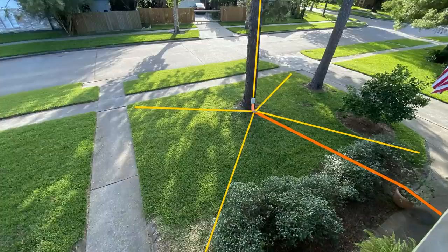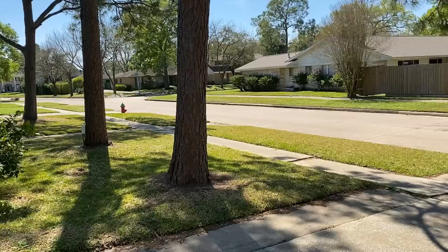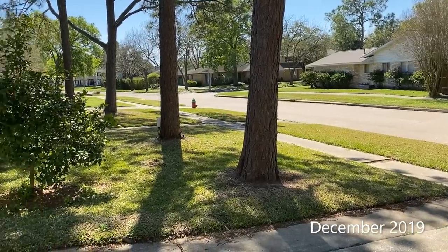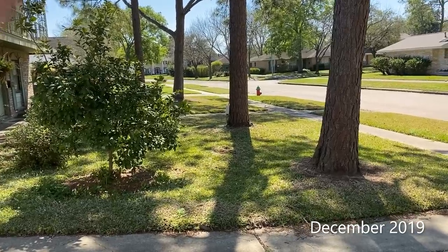These are the longest radials at just over 20 feet. Two radials would have to be curved slightly to wrap around the tree. Another 18 radials would be laid down as symmetrically as possible around the base of the antenna for a total of 24 radials. These radials would be laid right on top of the lawn and secured with lawn staples. I've heard that grass would grow right over the radials, which would hide them as well as prevent people from tripping over them. Since this sounded much easier than tearing up the front lawn digging 24 trenches, I was willing to give this method a try. I waited until December when the grass was completely dormant and mowed the lawn very short, so I could get the radials as close to the dirt as possible so that in the spring the grass would be able to grow right over them.